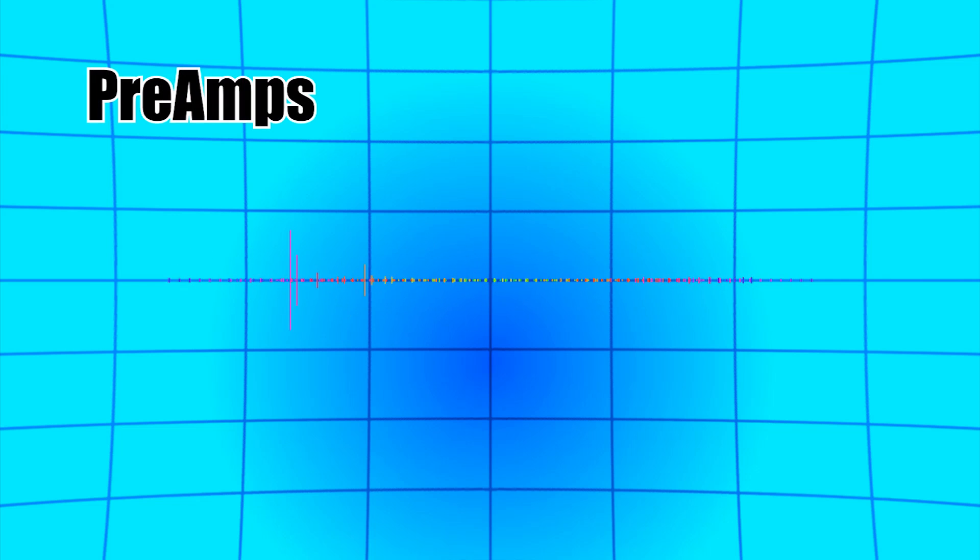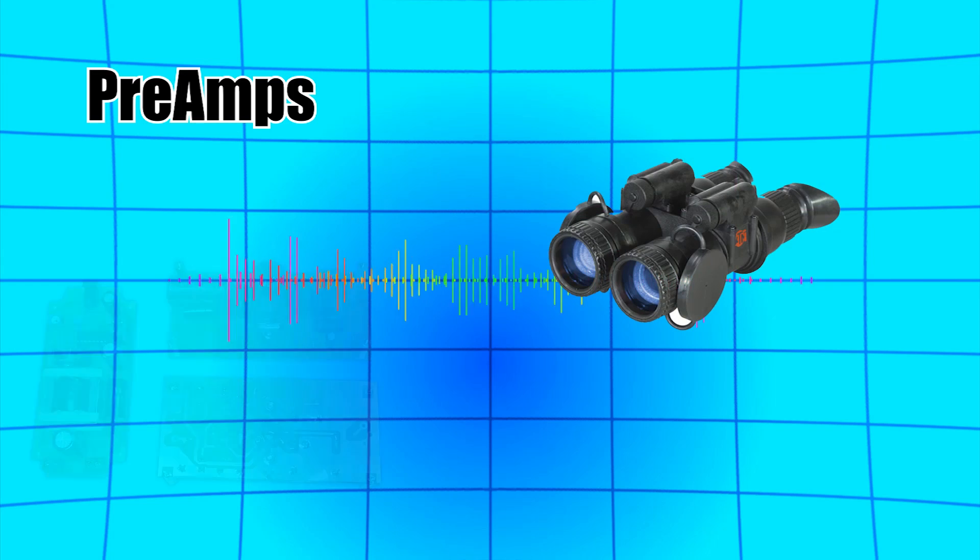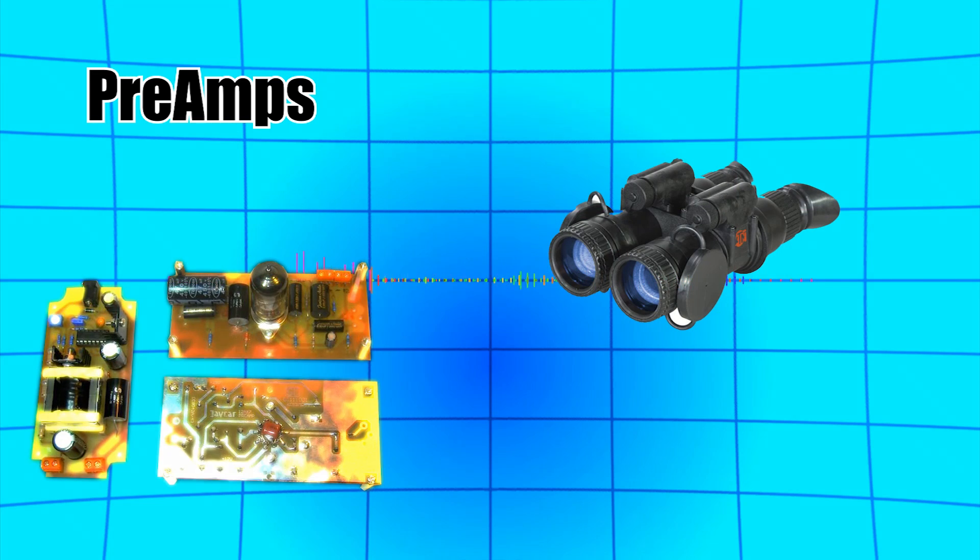Another thing to mention is the preamps. These are inside the device, so you can't see them unless you have thermal vision — and they're really hot for some reason. A preamp is what boosts the audio signal when you turn up the gain. Different sound cards have different quality preamps. Some will make a lot of hiss and noise when you turn the gain too high, but Focusrite are known for having good quality preamps that don't give off much excess noise.